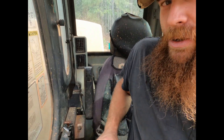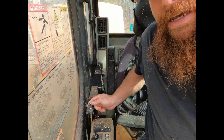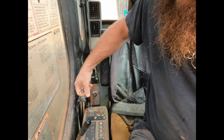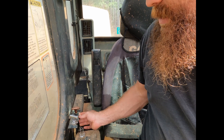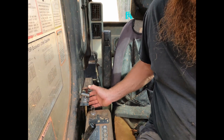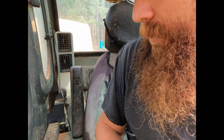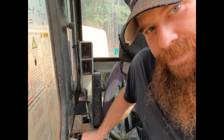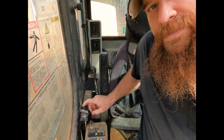A while back I rigged up a turn lock style, but the problem is when you start pulling on it, these cables have no real sheath and they're not jacketed, so they end up binding up in the back. I can pull on this all I want and it ain't going anywhere. Also, the engine stop cable is up here — when I got the machine somebody had relocated it back here. It's an emergency stop but usually rests underneath the seat or on the outside edge. The solenoid for that is very expensive, so I'm content to keep working with this cable, which was $25 — it was an okay test but I'll show you on the back where it's binding up. I've got a new solution.